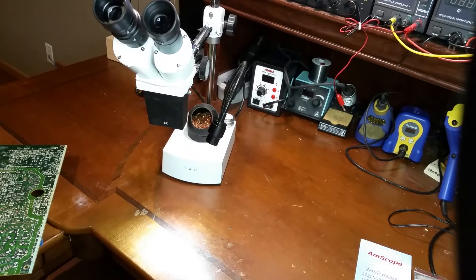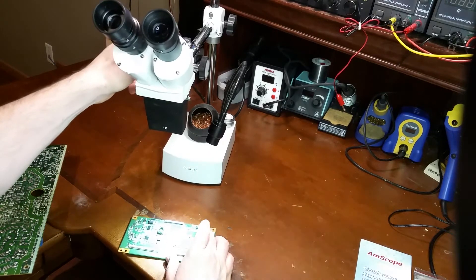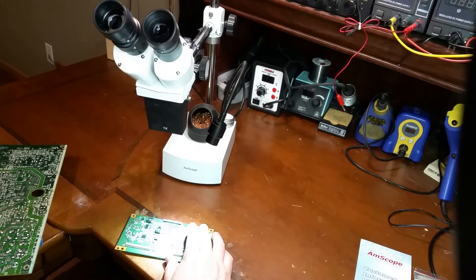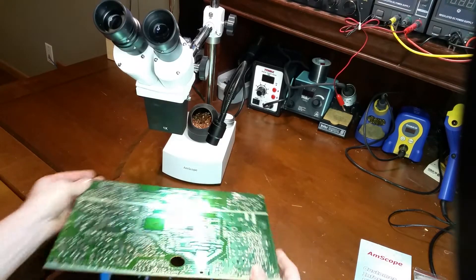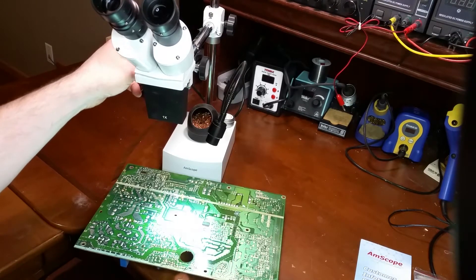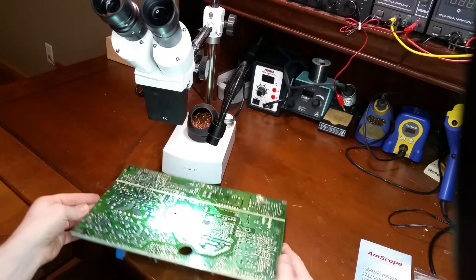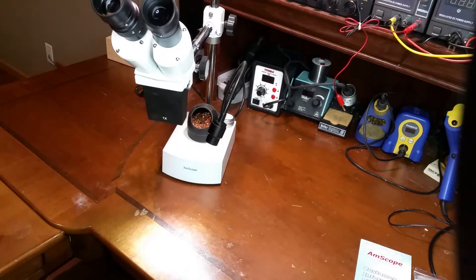The next limitation is when you're working on a flat board, your eyepiece is at a good level for desk level. But for tall boards — like this board here is about two inches thick — that means I have to bring the eyepiece up about two inches to get it into focus. Now you're kind of hunching funny at your chair to look down into it, which can be uncomfortable if you have to do it for long periods while reworking something. Again, not the end of the world, but something to think about.